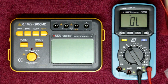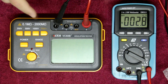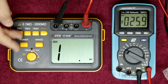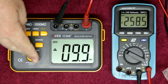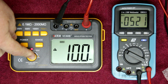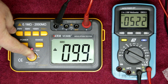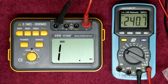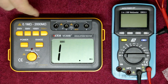A common question is the actual DC output voltage of these devices. So I'm going to check them and see what we're getting. We can't go too high with the multimeter in question, so we'll hit it with 250 volts first — and we've got 258 volts DC, with my multimeter showing 9.9 mega ohms input impedance. At 500 volts we've got 521 volts, still showing 9.9 mega ohms. I'm wary to do 1000 volts since that multimeter is rated max 600 volts, but I'm confident it'll be well within spec.